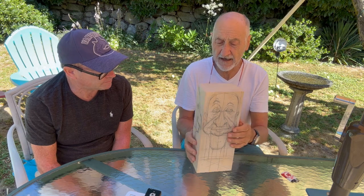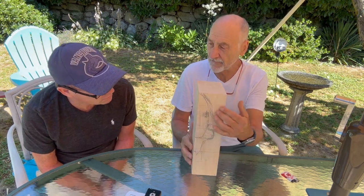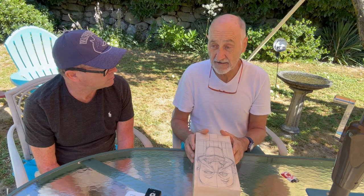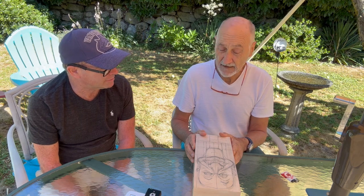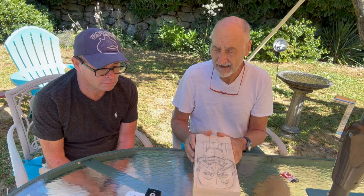Okay, right, great. And then that would be the front profile. Once I've established that, I would go to the side profile and rough cut that. And it's all in the book anyway. Bandsaw, a big 12-inch bandsaw, is critical. You can do it all by hand with a hand saw, and that's the way I started in the early days. But a bandsaw is really a big help. It makes the work so much easier.